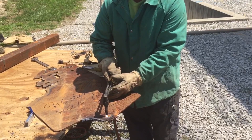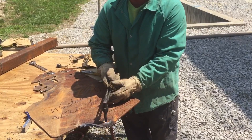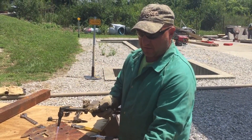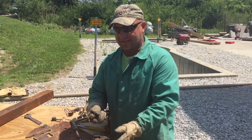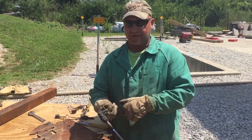I'll work the cut around to make a nice neat hole. We're going to use this for rigging — for shackles or clevises — so you want a nice neat hole. You can see it's nice and smooth inside, with minimal slag on top and minimal slag on the bottom, giving you a nice clean hole. And that's all because I had a proper flame, proper angle, and proper cutting speed.